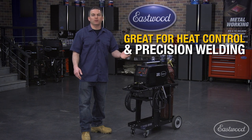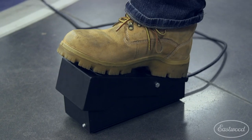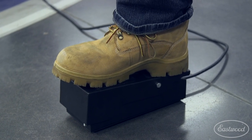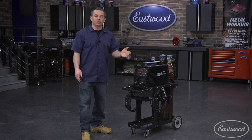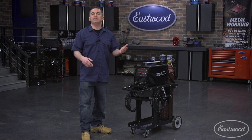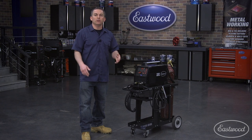This is useful when you're welding thin material and you want to minimize distortion, prevent blow through, or focus an arc on the edge of a piece of metal. The pulse frequency is how often it pulses to a preset amperage. You then control how long it maintains that amperage before dropping back down and repeating the cycle. You can still use the foot pedal to control the amperage, which is nice when you need less heat — like if you're getting near the end of the piece of metal you're welding and it's getting hot. You can let off the pedal to lower the amperage, which will lower both the max and minimum amperage at the same rate.